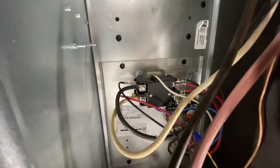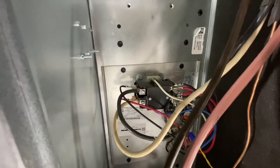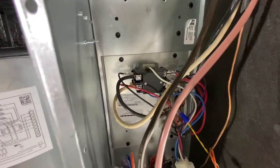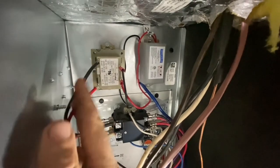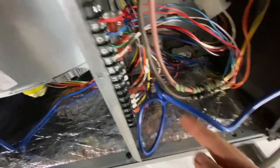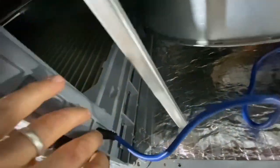First thing you want to do is check your power source and make sure it's turned off. The 240-volt connects to the left side and the ballast connects into the low-voltage side of the transformer. So we've got the 240-volt on this side and the 24-volt coming out of the other side going into the ballast. The ballast is going down through this hole back here, coming up through here — that's the hole I made into the side — and it goes into the light.